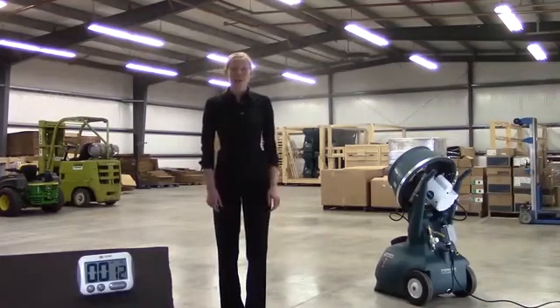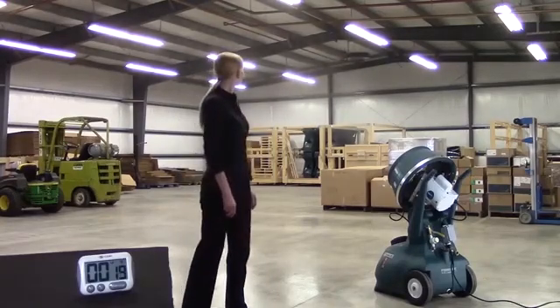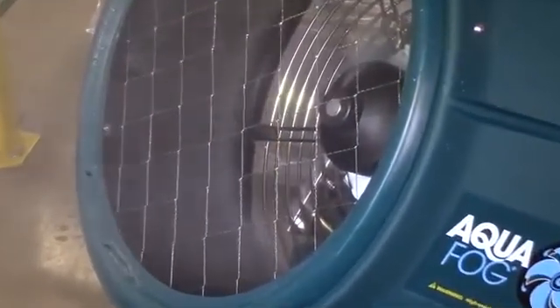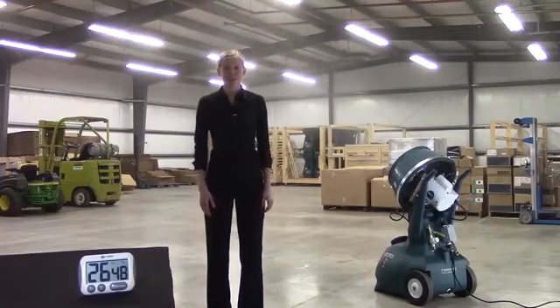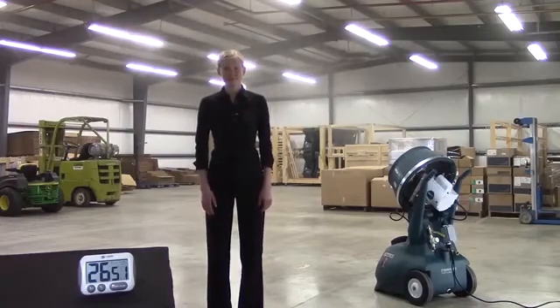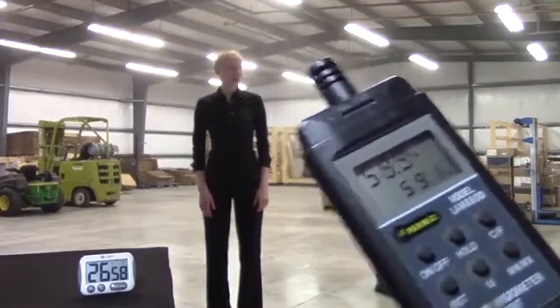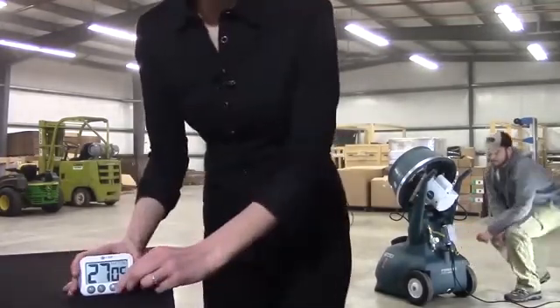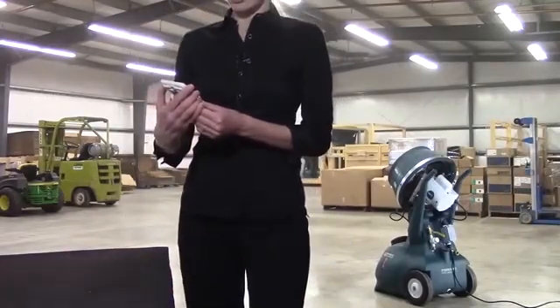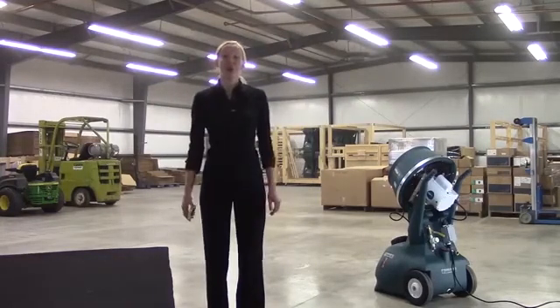Without a black background and special lighting, it's hard to see the fog, but it's there being propelled and soon we'll see the results. We just checked all four corners of the building and we're at least 53% RH with a differential of 2%. It took 27 minutes and 6 seconds to accomplish the increase of 30%. We hope this will help in your planning.